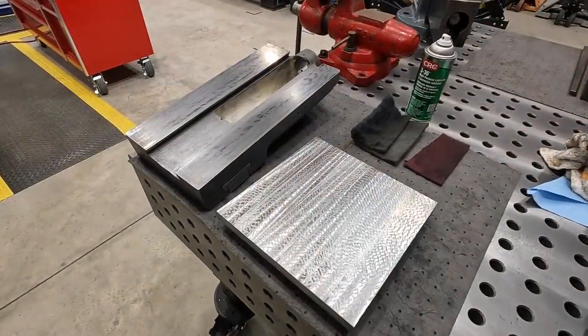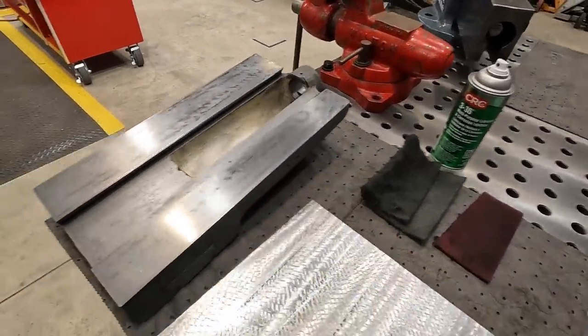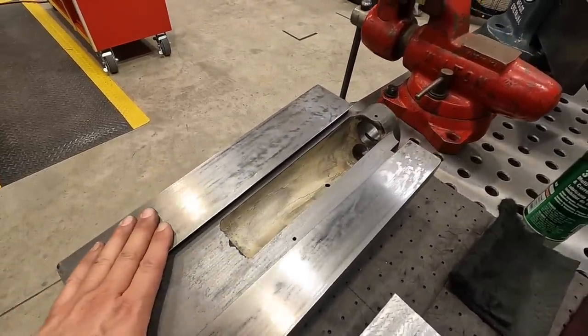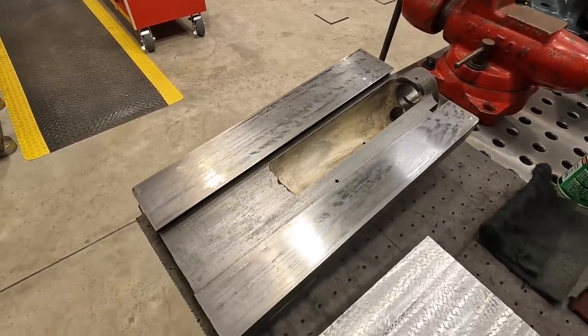So we're getting back on our American Pacemaker compound, and what you've been seeing me do is get it cleaned up, just Scotch-Brite and some lubricant there, to try to get any of the surface rust off of it. And we've got the surface stoned right there. The next phase of what I want to do is apply our crosshatch pattern with our power scraper.